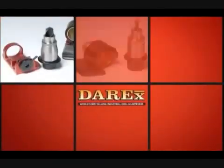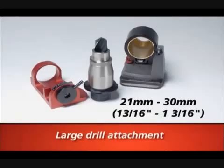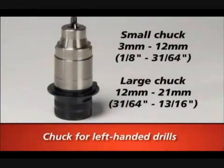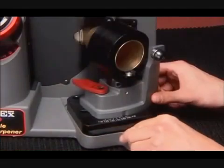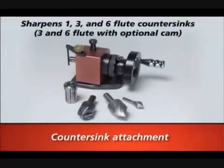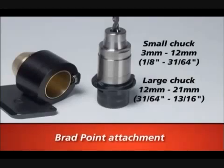Attachments. A variety of attachments are available for your Derex, available for purchase through Derex.com or by contacting your local distributor. The large drill attachment will allow the XT3000 to sharpen drills from 13 sixteenths of an inch to 1 and 3 sixteenths. The 90 to 120 degree attachment allows you to sharpen spotting drills. Left-handed chucks are available to sharpen left-handed drills from 1 eighth inch to 13 sixteenths inch. The XY table attachment is necessary to use the countersink, brad point, and step drill attachments, and is attached using the quick disconnect feature. The countersink attachment allows you to quickly and easily sharpen countersinks and attaches directly onto the XY table. The brad point attachment sharpens drills from 1 eighth inch to 31/64 inch, with an optional larger chuck that can sharpen drills up to 13 sixteenths inch.